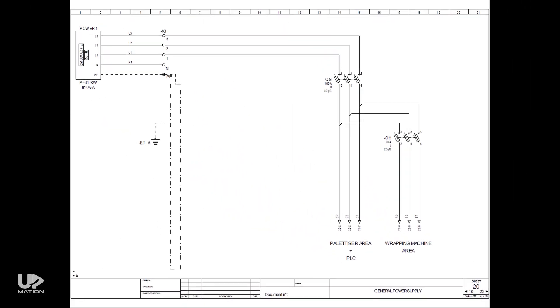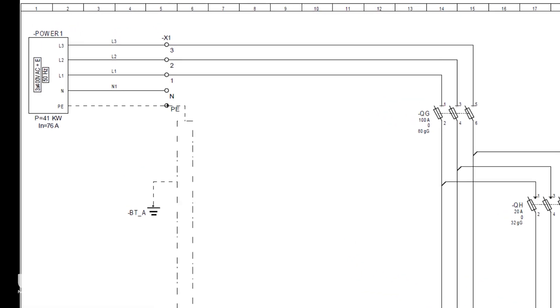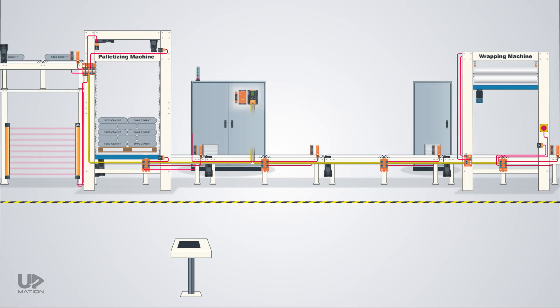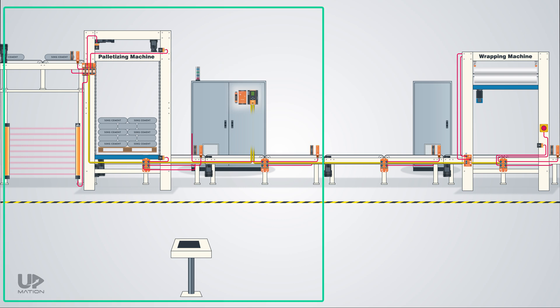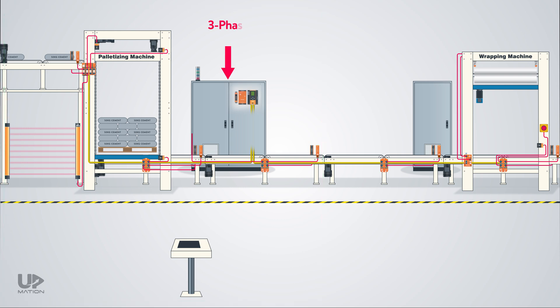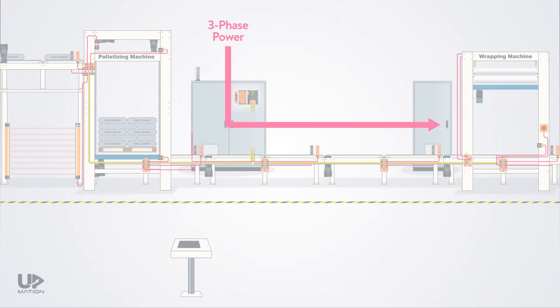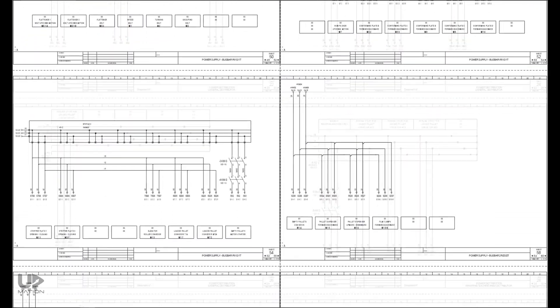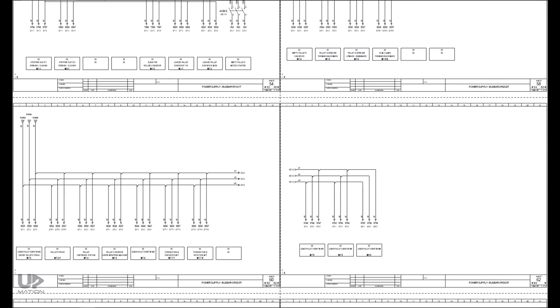The first part of the drawing is assigned to power distribution across the panel for different purposes, whether it is a three-phase power, like here, or it is a one-phase or 24V control power. This electrical and control panel belongs merely to an individual, yet central part of a packaging machine. Therefore, in addition to distributing the three-phase input power inside our electrical and control panel, the designer considered transferring the power to other sections of the packaging machine as well. Two fuse disconnectors with different ampacities have been used here, and power distribution continues until page 62.